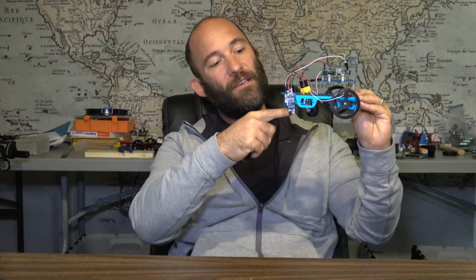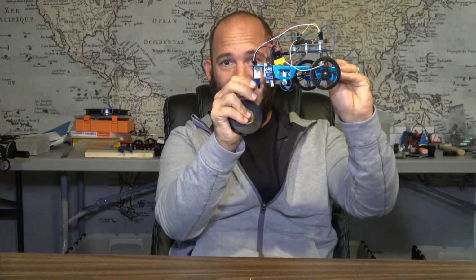So basically, how we're going to write the code is, when the sensors detect an object in front of them, but how we've positioned these sensors, they're now pointed downwards, so when these detect something under them, we're going to have the wheels move forward. When it does not detect anything below it, because it's going over the tape, and the tape is going to absorb all of that wavelength, we're then going to code it so that it turns, so that both of the sensors start detecting something.